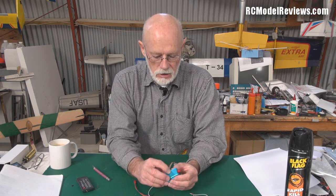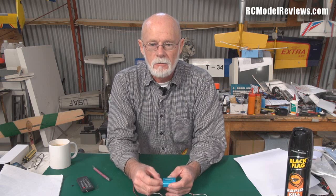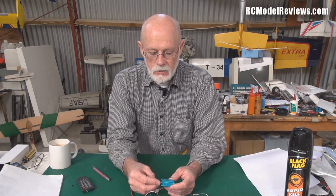Anyway, I'll get on with putting this on the bench. We'll test it out — I think it's supposed to be 100 milliwatts, we'll see what it actually does. The interesting thing is we may see if we can change the frequency, because these have a little circuit in here, a little phase lock loop. Sometimes, depending on the chips they're using, you can actually alter the jumpers or the little settings in there to get operation on different frequencies.